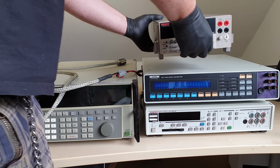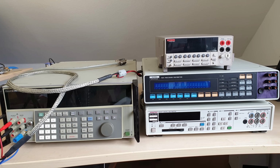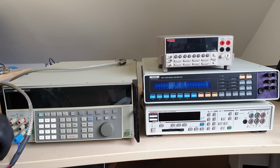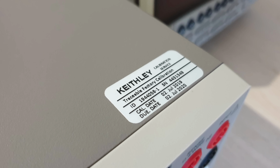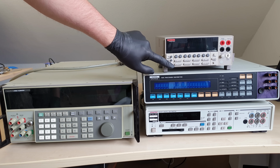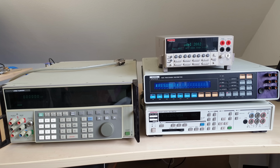I'm also setting up my own 8.5-digit meters to come along for the ride, but those haven't seen a calibration in years and are nowhere near as trustworthy as a latest generation 2002 straight from the manufacturer. I was a bit sad when that turned out to be just out of Cal too, when it arrived here July the 16th. Otherwise I could have adjusted the calibrator ranges manually to match Keithley's, and from there inherited the quasi-traceable accuracy to all my other meters. Oh well, as long as we can verify stability and linearity, we can always import the absolute accuracy later.